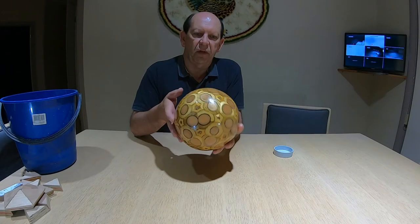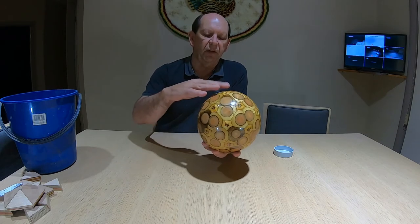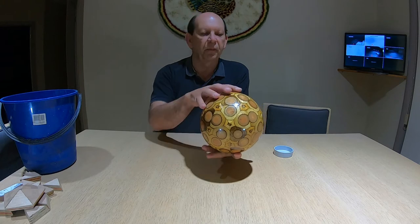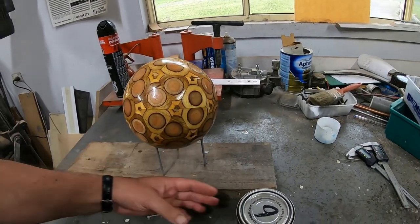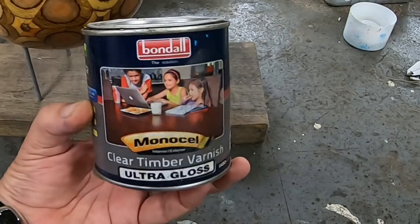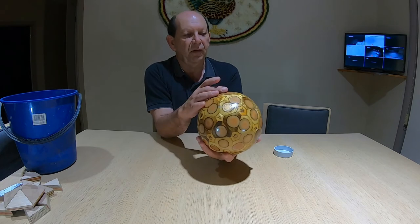The last part of the job was polishing. We put on three separate coats of urethane and did them in two parts — the top part first, leaving a gap at the bottom so it wouldn't run when being coated down the bottom. We'd put on a little bit of tape as a guide, lacquer the top very carefully to try and keep the air bubbles out, then turn it over once it had dried and do the other side. Then we'd sand it back with about 2000 grit and repeat that three times.